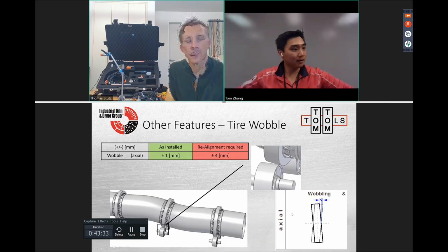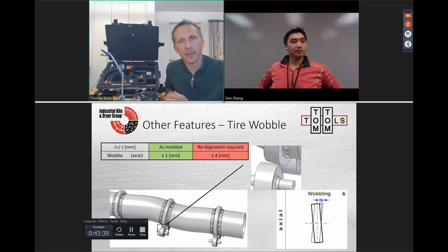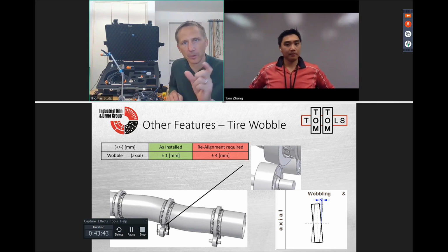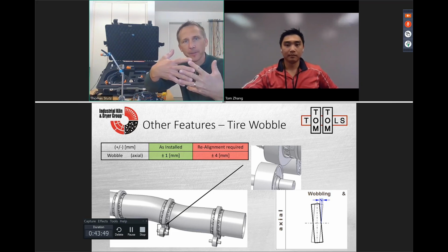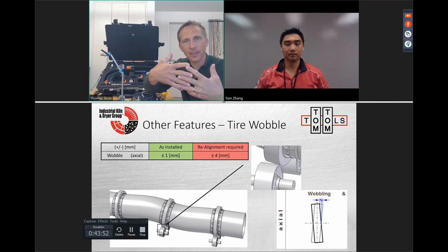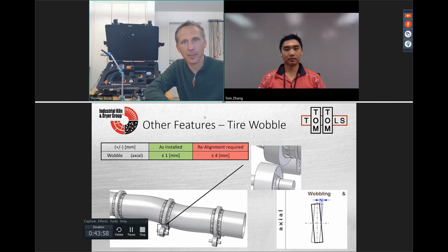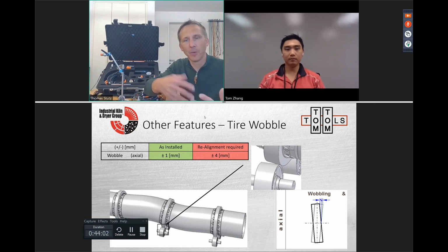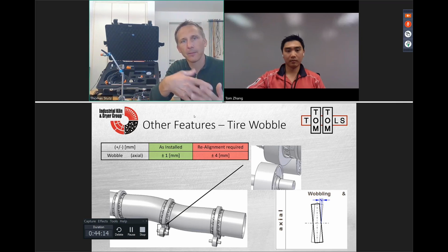Okay, yes, so we talked about gear. Go ahead. Yes, this depends also on the size of the teeth. Usually the kiln gears are made with a big module, so they have big teeth. And that's why they can allow a little bit of change in the engagement. But if we have smaller teeth, then we can afford much less variation. So that's why it has to be that precise. And the most important is that we always have clearance and not get locked into the gear. That would be very dangerous, that the girth gear would get locked on the pinion, and we would overload the pinion and we would damage the drive.